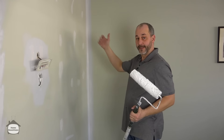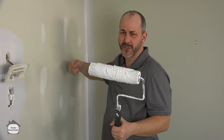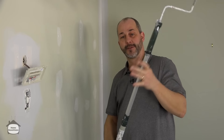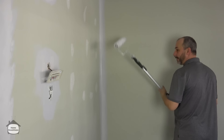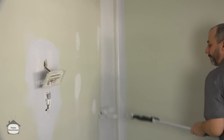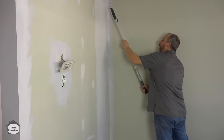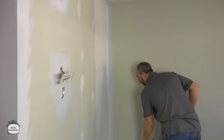I like to paint from floor to ceiling. If you're holding the roller by hand you won't get through the whole room without taking a break. Use an extension pole — step back from your wall so you're comfortable. You should be able to hit the ceiling and the floor without bending, leaning, or straining. Start about a foot from the top because there's a lot of paint on that roller, gently let it roll down the wall with no pressure, then add a little pressure going back up. Go two rollers wide on the first coat, draw a straight line, work your way back, pick up all the extra paint from the first run, and push it back towards the corner. With the locking system on the cage and handle, you can go extremely quickly.